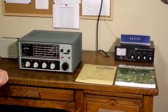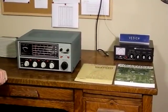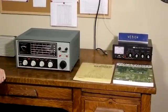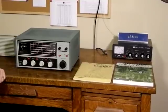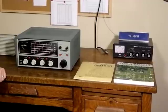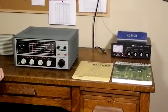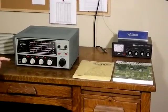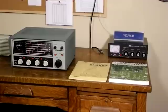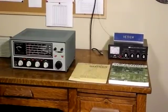What are its weaknesses? Well, obviously it doesn't have the features of modern solid-state microprocessor-controlled rigs. It had no built-in speaker, or even a matching speaker. There's no break-in capability, although you can switch between transmit and receive with one switch if you have a TR switch. It's not very sensitive, especially on the higher bands — the sensitivity is claimed to be 1 microvolt, though it likely doesn't meet that on the higher bands. The S-meter is only useful when the AVC is enabled and RF gain is at maximum, so it's typically only useful for AM signals. It has a fixed 3 kHz bandwidth with no narrow filters suitable for CW or Morse code receiving. The noise limiter isn't particularly useful. It doesn't support the newer ham bands such as the WARC bands introduced in 1979 and some of the later bands. And like most vacuum tube equipment, it takes about 30 minutes to fully warm up and stop drifting, although drift was minimal in typical equipment of this era.